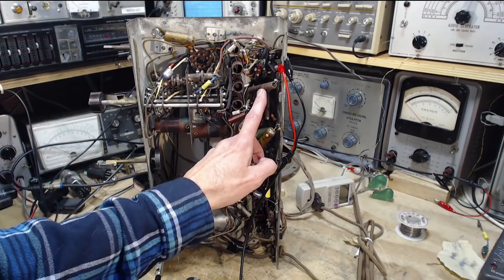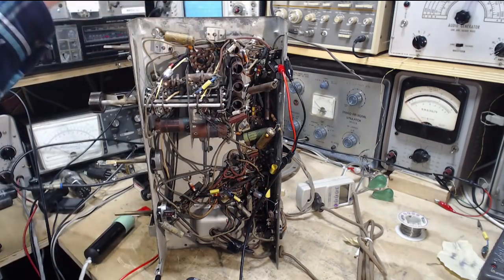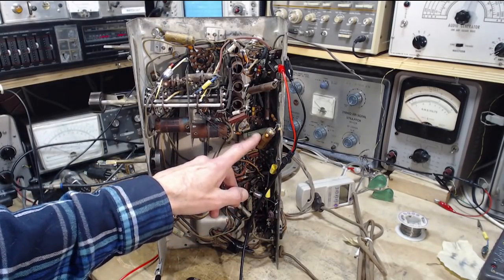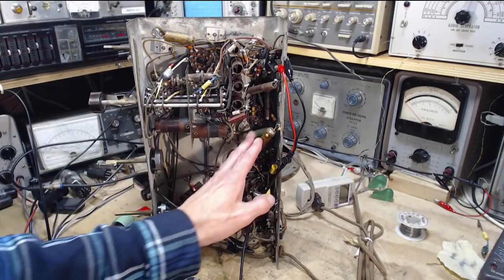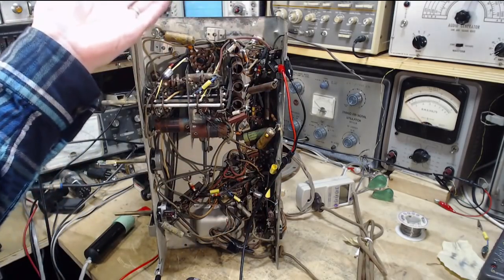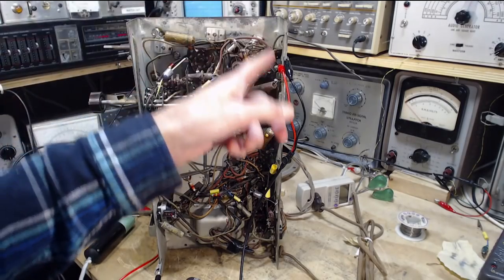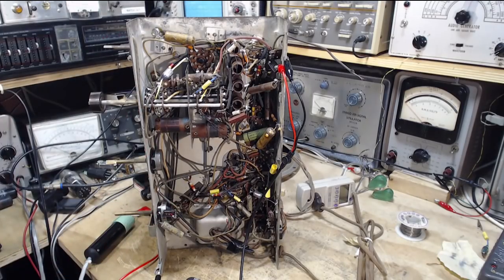Got a pretty ugly one here, but that's a fair ways into the radio now, and the weakness is apparent before this capacitor. Well, I got these two really thoroughly ugly ones, which are down kind of in the IF circuits again. If they're causing problems, it's coming later in the game than the weaknesses I'm finding up here. Apparent weaknesses. I just have question marks about everything.